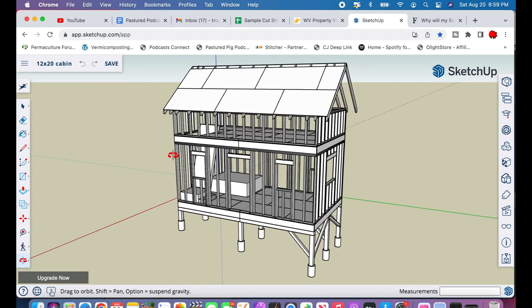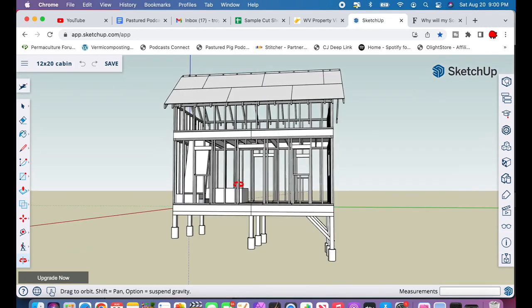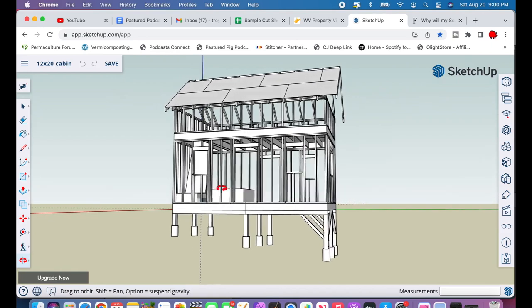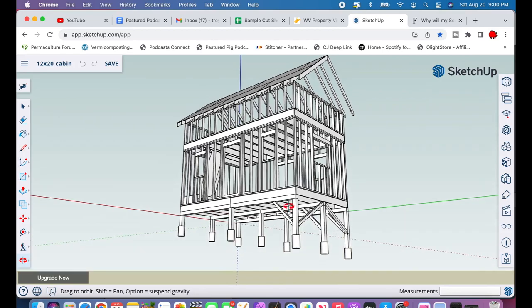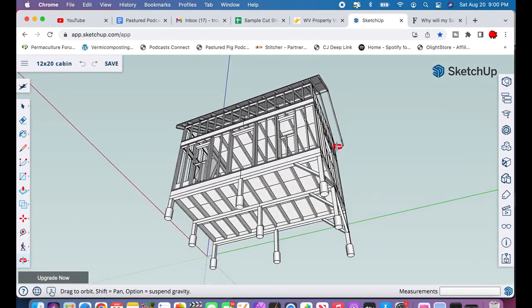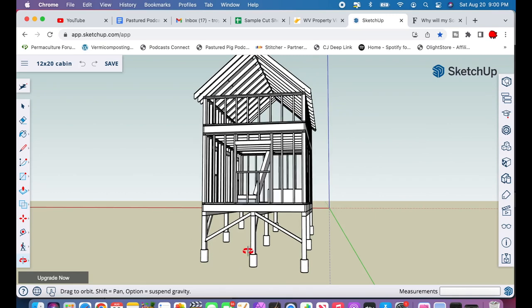So a quick rundown on what we're building: a 12x20 on a pier and beam foundation. We're going to do 10-inch concrete sonotubes recessed in the ground, protruding about six inches above grade, and then six-by-six treated posts up to the cross beams. The whole reason of going up and doing the work we did was to determine the amount of relief. The front corner's 22-inch crawl space means the back — the lowest corner — ends up with almost five feet of crawl space, which we can utilize.